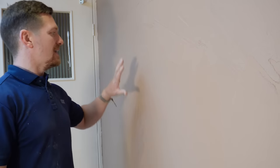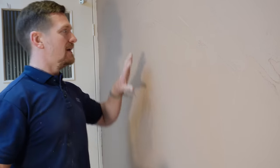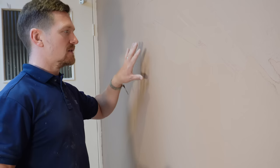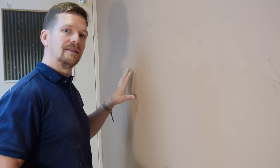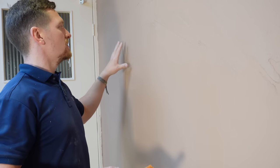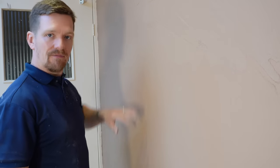So here's where everything changes. We've got the two coats applied and it's been flattened once with a spatula on the second coat. What I used to do with the old sponge floating was flatten it more until it was semi-dry and then start the sponge float process. What we're going to do now is get it whilst it's still green — it is firming up. The reason I like to do two coats with one mix is that once you've applied the second coat and cleaned up your tools, this is now a good time to use the sponge float to get rid of any lines and ripples.